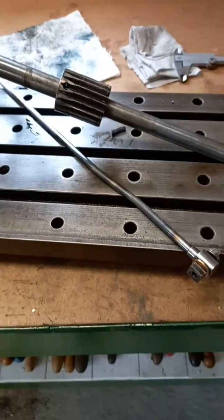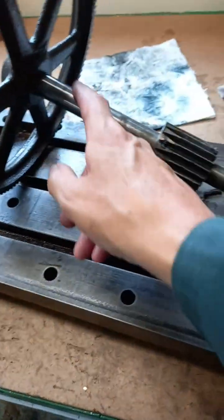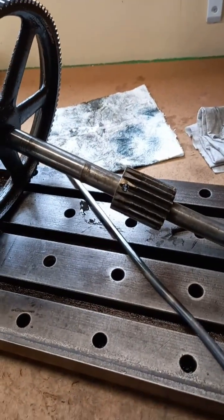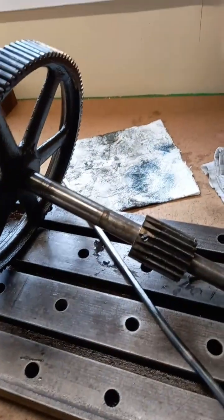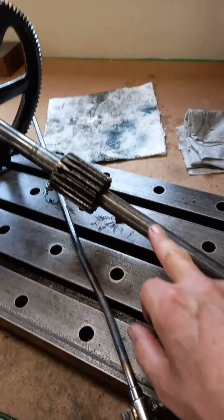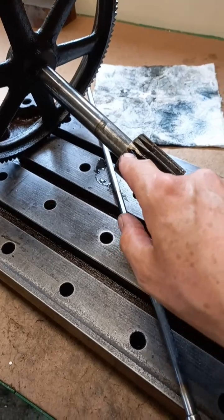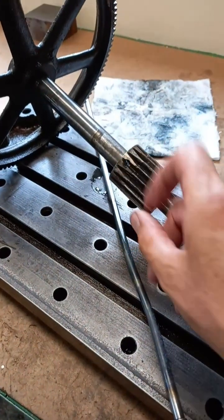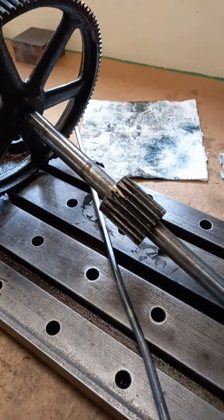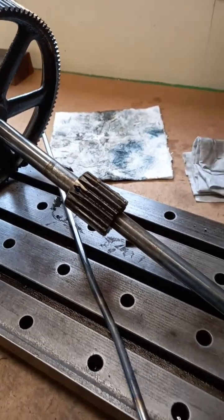What we've got here is the original shaft — there's a little wear on this; it should be 13/16ths here. I've checked the bore in the planer and we've got about five thou clearance, but it's a 125-year-old machine and it's still working, so I'm not going to do anything with it. The bore where the gear fits looks pretty consistent. So what we're going to do is get a taper reamer — I need to order one — ream the hole clean, put a brand new taper pin in, then slice the end like two legs and splay them apart so it can't come out. We should be able to repair this as soon as we get the reamer and the taper pins.